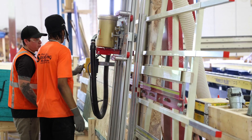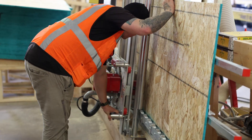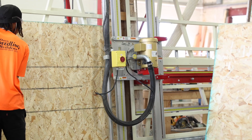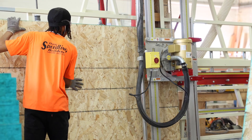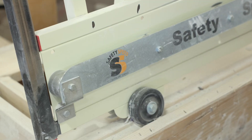With the industrial saw, for OSB and plywood we use 7/16ths, half inch — anywhere between half an inch to three quarters to two inches — because it has an adjustable bed. I've used two inches before where we had like a half inch of plywood and two inches of foam, and we just put it right through there, cut it with no problem, all at once, nice clean cuts. The industrial saw has a much bigger motor, bigger saw, and it cuts a lot faster and a lot cleaner.